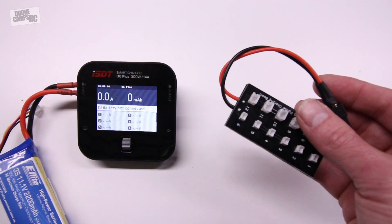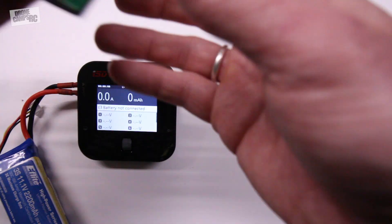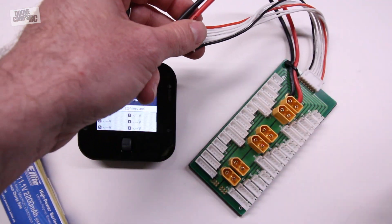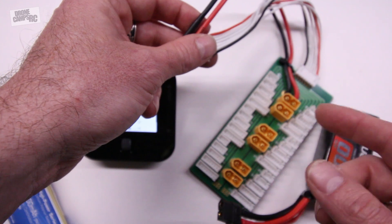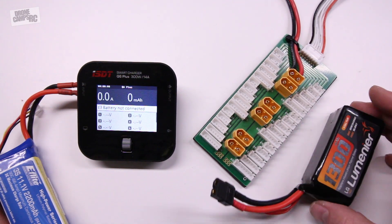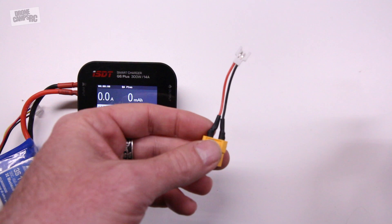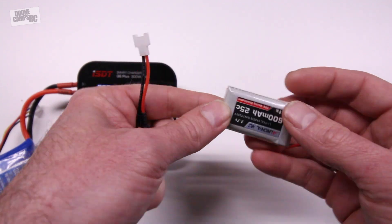I also have my 1S one — I got this off Amazon and put an XT60 on it so I can charge my little 1S batteries. And I have this one that I use on my large charger at home — it has an XT60 that plugs in here and the balance port right there, so now I can charge up to six batteries at once. You want to charge all the same cell size — you can't charge different cell types because it will not operate correctly. Also, when you charge with these larger balance port boards, make sure all your batteries are at relatively the same voltage when you plug them in. I also have a little hub-stand style charger for my 1S batteries — this one doesn't need a balance lead since it's just one cell.